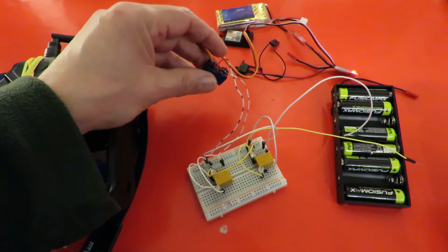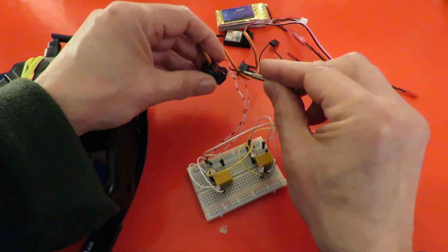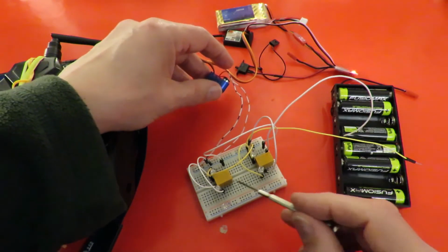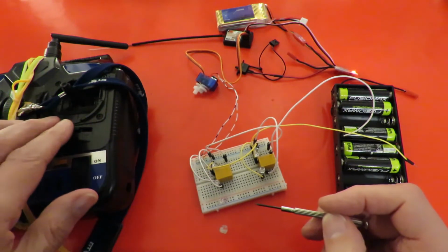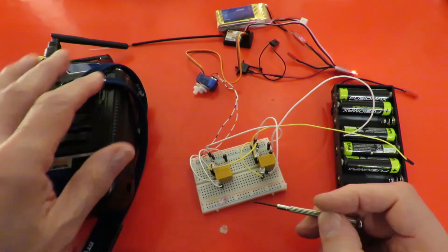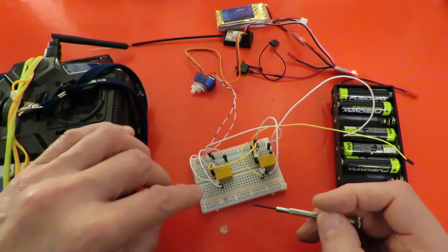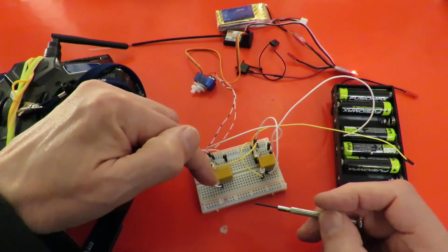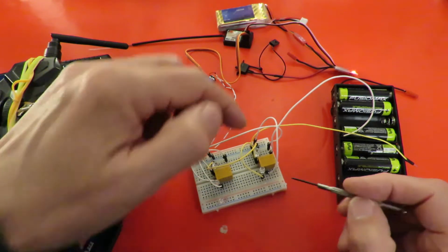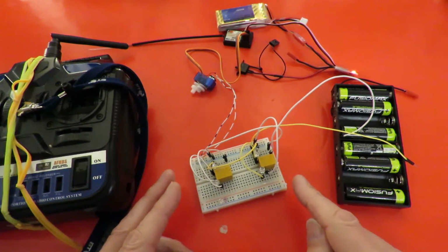And in the comments, I apologise, I can't remember who it was, but somebody said, well, why don't you just take the servo apart, use the wires that go to the motor, put a diode on them, so that when you turn one way, instead of turning the motor, it makes one relay work because the diode makes it only go one way, and when you turn it the other way it makes the other relay work. And so that's what I've set up here.